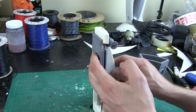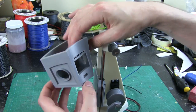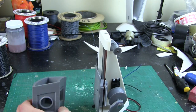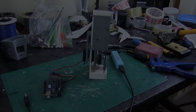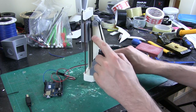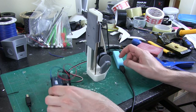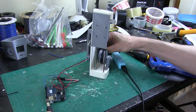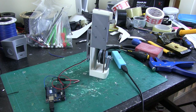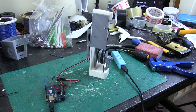On the back of this will be mounted the thing which holds the periscope, and that needs to rotate and have some other parts below it so it can pop up and down - that's the next thing I need to make, with another servo to turn it. I've tied a piece of NinjaFlex around and crudely coupled the ends with zip ties and attached that to the carriage. I've written this Arduino sketch on a Uno which just sends the servo up and down, and it works - mostly.